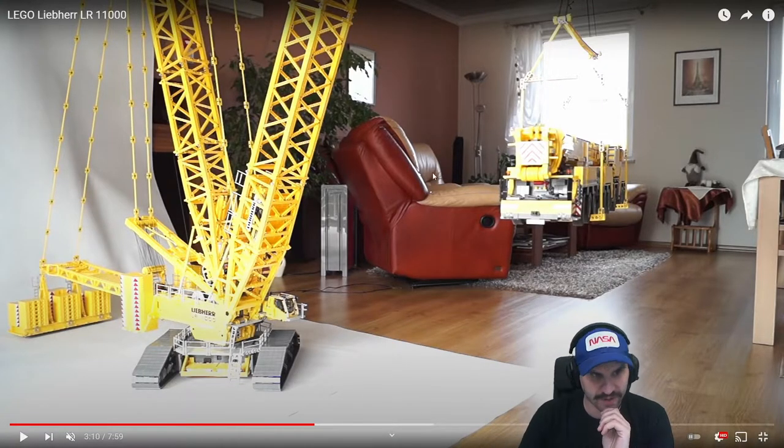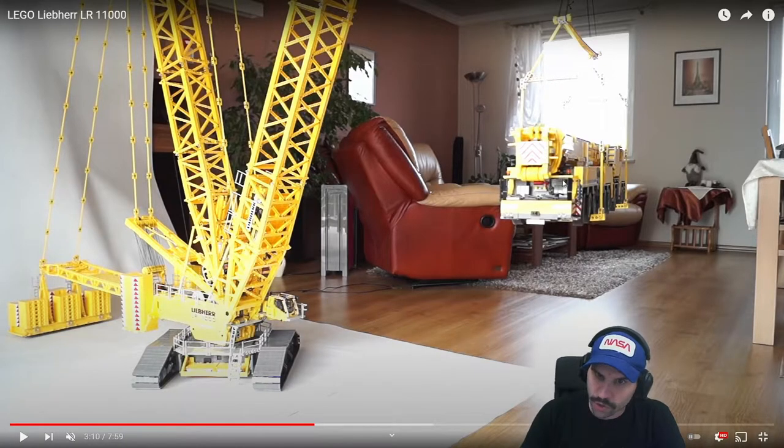Yes, that's fine. So, because he's picking the truck up so far away from the main pin, which is the pivot point, you're picking up far away from the pin. You need to run an equal amount of weight, the same distance relatively, away from this.